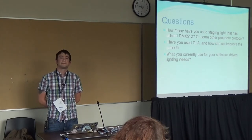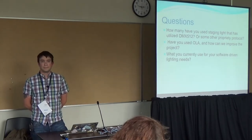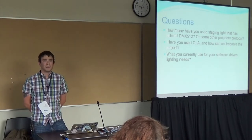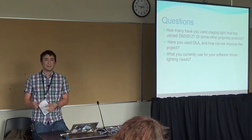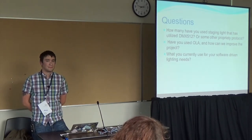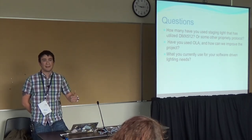So you were using the PRU, which is a little microcontroller on the BeagleBone. Can you drive this with just a normal Arduino? You could, but the question is how you can transfer data deterministically at the same time. Okay, so the PRU gives you that capability. With the Arduino, you're doing a little network, it's still going to be a lag.